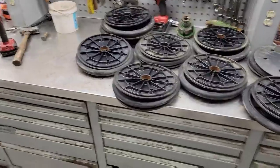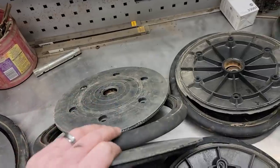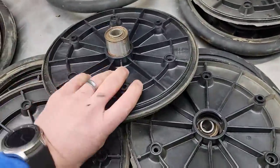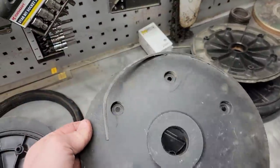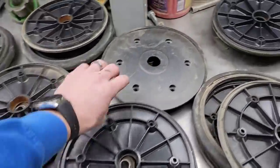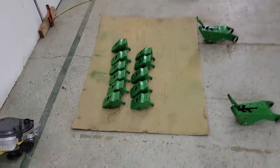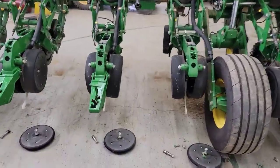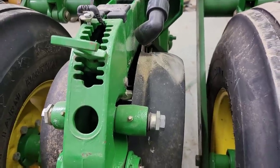There's a whole pile of closing wheels taken apart and you can see the wear on them much more significantly now. For example, look at this side of the wheel compared to this side — they started out identical, which is why we're seeing the wear and chipping. Basically half of every wheel is going to get replaced. Some aren't worn through yet but they're thin, so I might reverse some of those, which would probably be sufficient.